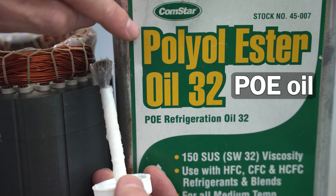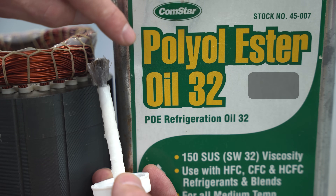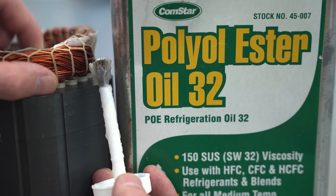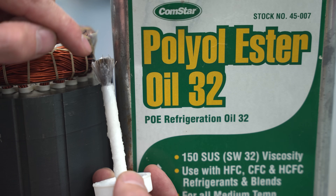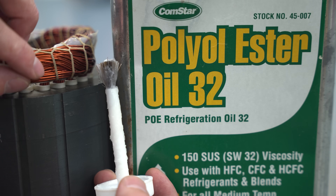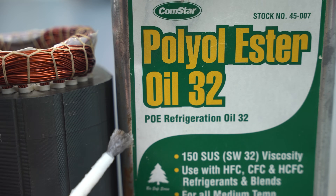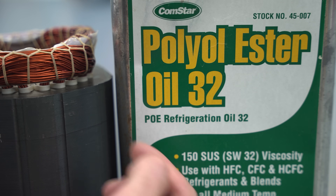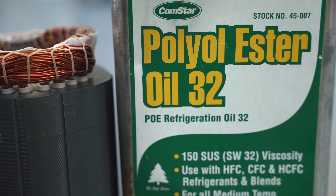What we're really talking about is avoiding damage to the electrical wires inside the compressor - the refrigerant and refrigerant oil circulate through the system, and so would this flux throughout the system for the life of the system. Older systems that had R22 typically had mineral oil instead of POE oil. POE oil is used with R410A, R32, or 454B, and it becomes very acidic very quickly if it's mixing with any water or anything like that. Acid in the system can break down the electrical windings inside the compressor. You don't want to pre-contaminate the system with any type of acidic compound such as flux - it can eat away at the resin separating each one of those electrical windings, causing a short to occur and eventual burnout of the compressor. I have had technicians say they only put a little tiny bit of flux on the joint, but I would highly prefer technicians to not pre-contaminate the systems and only use the high temperature brazing rods.